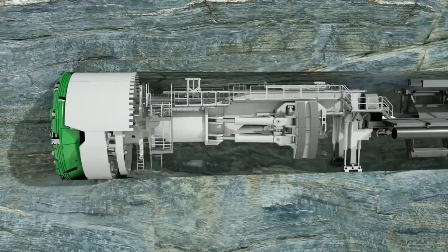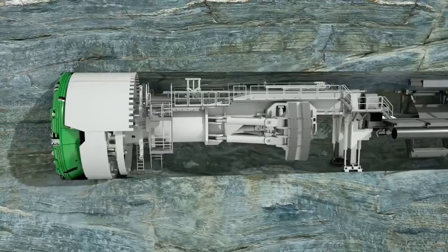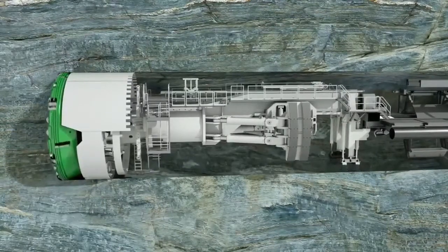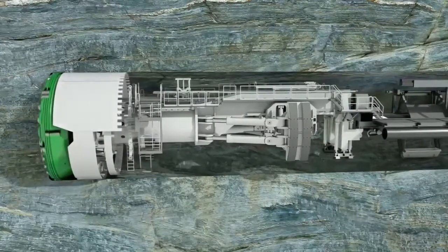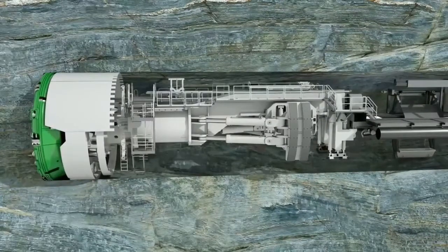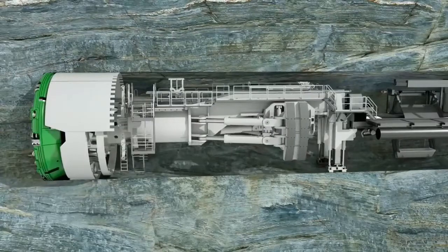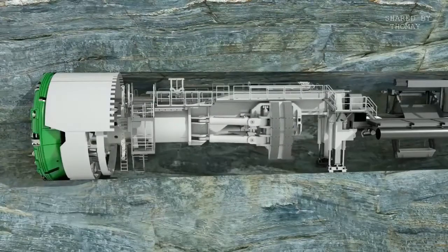They are telescopic and stabilize the TBM during the boring process, prevent vibrations, and thus reduce wear and tear. A roof shield, often equipped with a finger shield extending backwards, protects man and machine against rockfall. The weight of the tunnel boring machine rests on the invert shield. It slips directly over the tunnel floor and serves as a pivot point for steering.